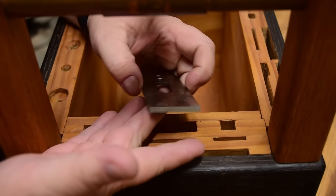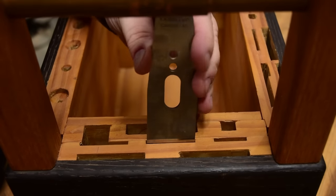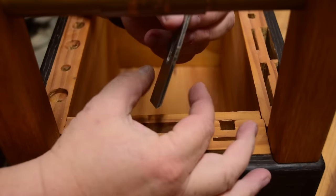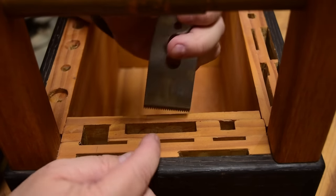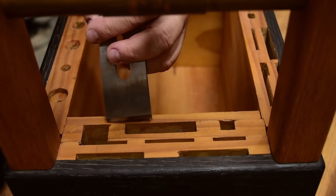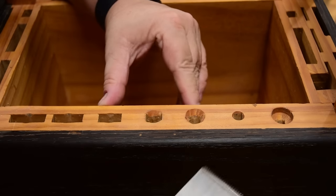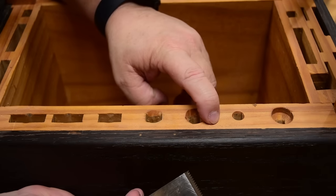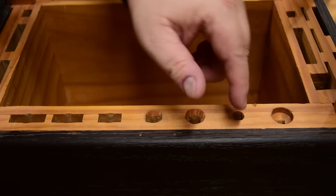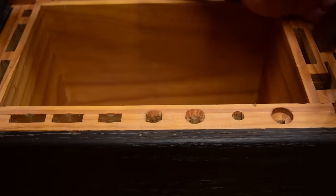To make the laminates, I laid out all the tools I wanted to hold upright so they'd be easily accessible. I'd physically lay each tool down, mark the sides, then use the router plane to cut the slots. I did that to one side of a board and the other side, then glued another board on top to create each section — every other one the same way. I added a thin board laminated to a three-quarter-inch board to get all my chisel thicknesses. In hindsight, I could have rotated one board and glued it to gain more thickness, but that's only something I figured out after a decade of use.